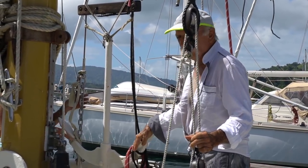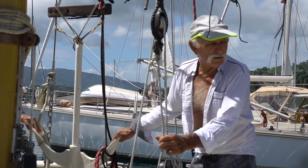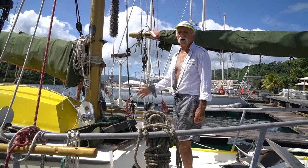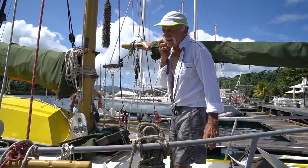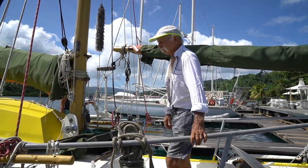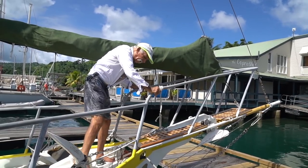It's a Herreshoff-kind of design basically — a three-part anchor. I made a few of those and gave them to friends, and I ended up with one of my own. I think the fisherman anchor is the best all-around anchor. You can flip it over and it resets. You need a second anchor or stern anchor sometimes, but it grabs just about everything and it's especially good for coral. I really like that kind of anchor.